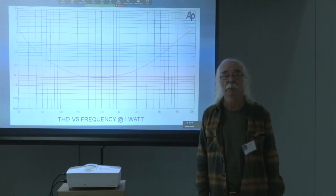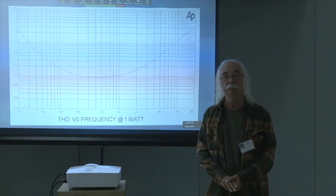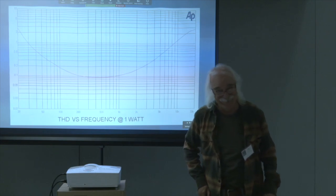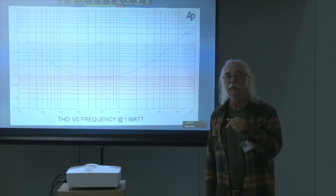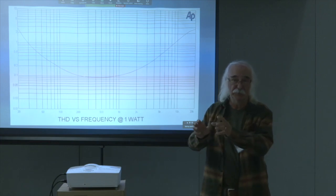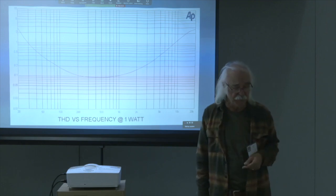What about running it off of higher voltages, like if you've already built a linear supply for the Mini and would like to try that? Well, first, of course, we need to really run this hotter, I'll tell you. We've got some physical limitations with the transistors. Actually, those transistors can handle it. It's the heat sinks that start glowing at some point with higher voltages because the dissipation's there.